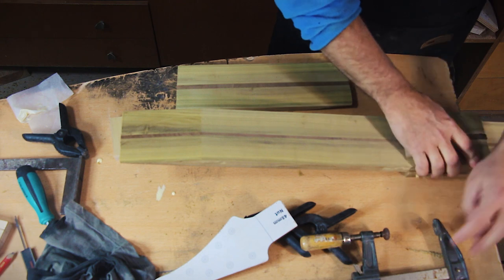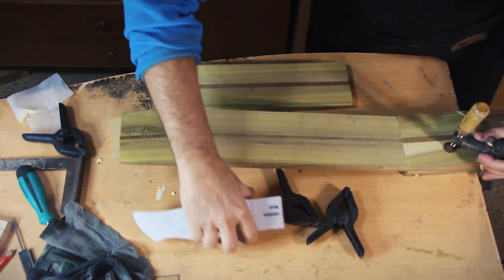I then do some sanding and try to maintain — if not improve — the squareness of the surfaces. A belt sander would be preferable here, but if sanding manually, use a large block or sanding beam. Another option is attaching a sheet of sandpaper to a flat surface and running the piece on top of it. For gluing purposes you don't need high-grit paper — in fact, too smooth a surface will not adhere as well. Most importantly, you just want the surfaces to be square and flat.